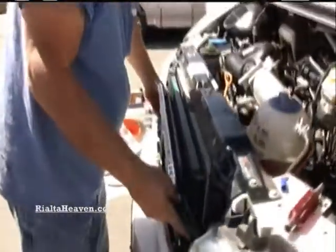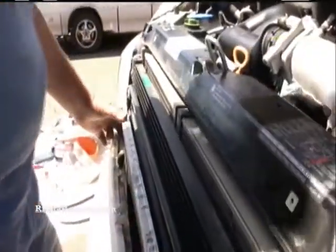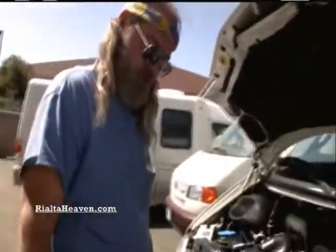Mark a spot down in here and kind of wiggle to get the hoses down in there and get the cooler in. Don't force anything, just take your time — but you're going to realize that putting it in there it's going to stop, because this bottom hose clamp is catching on the grill, the plastic work on the grill. It's just to the inside of this little support on the grill, so we're going to pop the cooler back out.